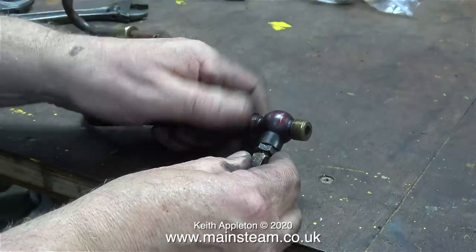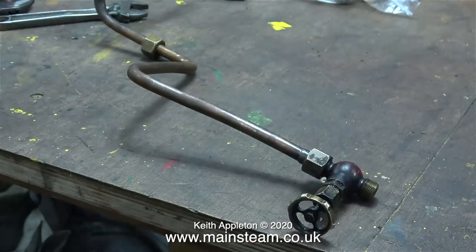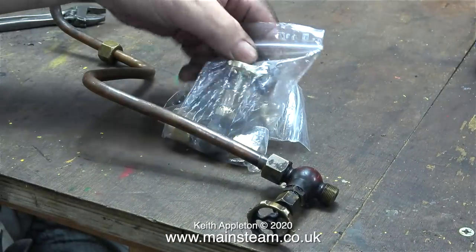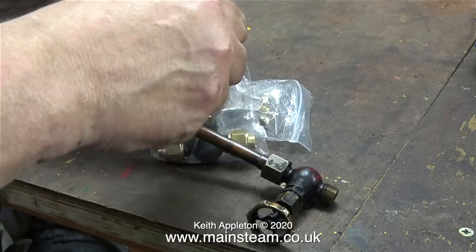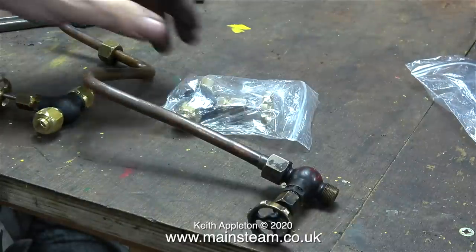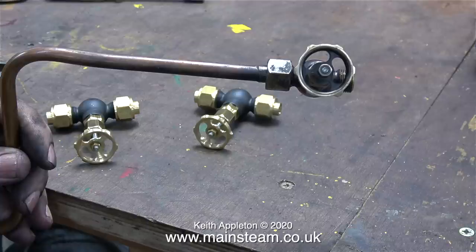The bend is completely out of sight when it's fitted back to the engine, and despite the kink it doesn't restrict the steam flow to the injector in any way. These valves are quite different to normal globe valves — they do not have coned unions, they have a flat surface and a flat union, which seems to be the way it is with larger items. While I have the pipe out of the engine, apart from adding an extra valve I'm going to put another valve in the circuit. In the plastic bags I'm just opening are two brand new globe valves made by David English of Jubilee Fittings. There is nothing at all wrong with the existing injector steam valve — I'm obviously not going to throw it away, I'm going to remove it and put it in my box of injector steam valves.